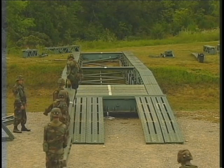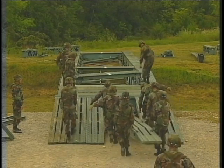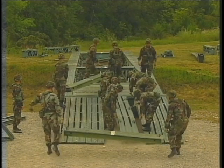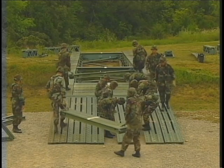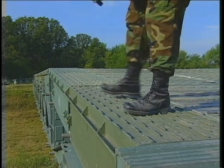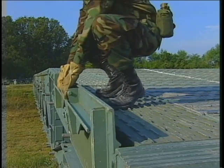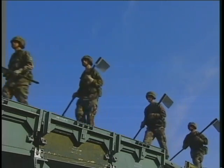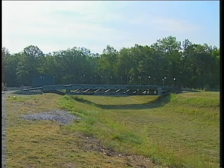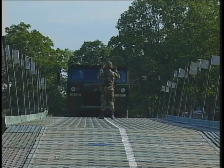Start placing the deck units. Walk up the left ramp and place the unit down, then walk across the deck and return to shore on the right ramp. Continue until all the deck units are installed. Install the bridge's curbs by hooking each curb onto the top panel rails, sometimes called the rain gutters. Your bridge construction is now complete and ready for inspection and approval by your unit OIC and NCOIC. You have now completed your mission and the Army can move ahead.